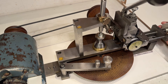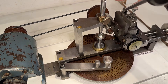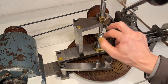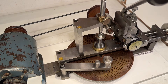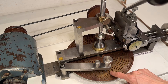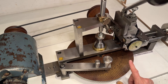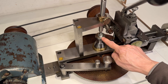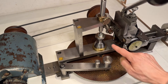It's my first time, I'm not a specialist. There's a clock installed where you can see how deep you go. I've already done the preparation — I have the blank, I put this gear cutter in the center. There's a screw which you can loosen and put it in the center with the help of the counter center. You can also put this one here to help find the middle. I found the correct line of holes and with a pen I already colored the ones I need to make 48 teeth and the correct division. I checked the concentricity of the blank — it's minus 400 and plus 500.